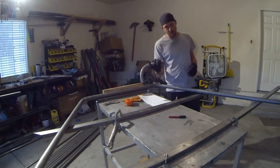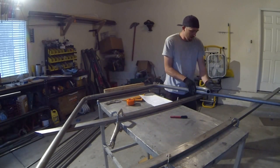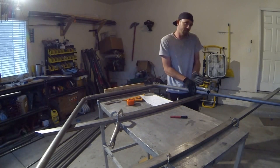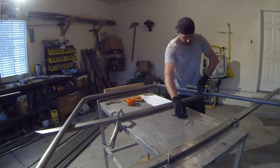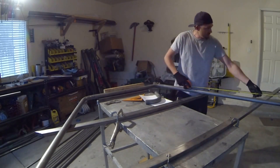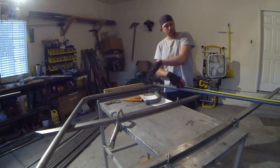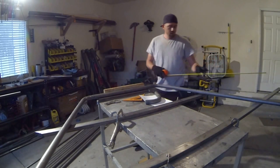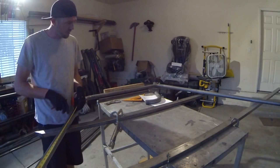What we're going to do is take our cheater here and eyeball it. I'm going to place it directly on top of the tube and figure out about where that bend is going to land. This is entirely up to your eyeballs, but you want to make sure that if anything, you come in just a little bit under as opposed to over. Where I have it land, I take a marker and mark out where the beginning of the bend is going to be. I don't want to rely on my eyeballs twice — I'll only do it once. Since this tube was measured out from exactly halfway, it's going to be the same measurement on both sides. I got 36 and 5/16 of an inch, and I translated that measurement to this side as well. Both sides are ready to be bent.